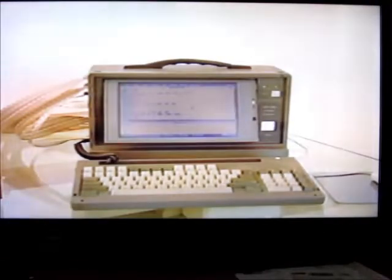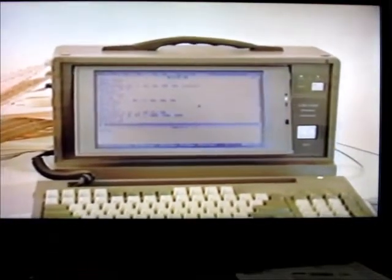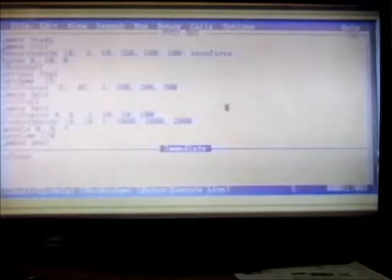The Zebra Zero is controlled by a modified IBM PC-compatible computer. The portable version of the controller is shown here. The Zero is programmed within a modern menu-driven environment. Programs can be modified and run immediately by the interpreter or compiled for standalone use. The entire control system runs under the standard MS-DOS operating system, affording a level of standardization and convenience not found in most industrial robots' homegrown controllers.